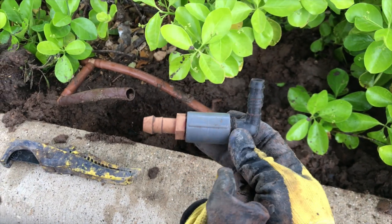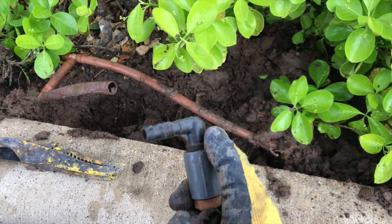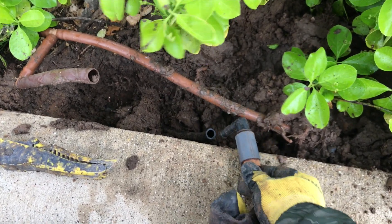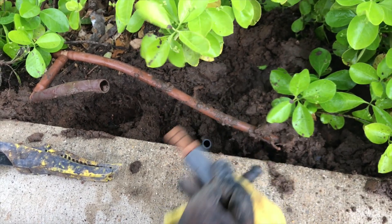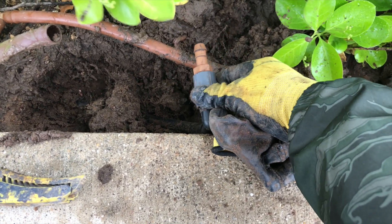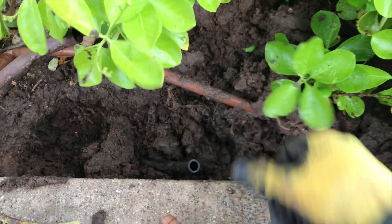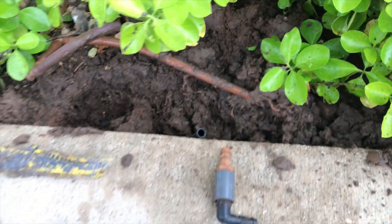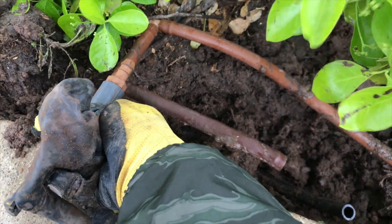This is the setup that you're going to want to use. I've got a half-inch threaded coupler — it's threaded on both sides. I've got this black fitting which is my swing pipe fitting, so it's the right size to go into my swing pipe. And then I've got a male adapter that's the 17 millimeter that's going to go into this. What I'm going to do to get that kink out is put this elbow on here shooting out straight over, then put a little piece of drip, move this over, put a T and put a small piece between here and that and then go into the T. Essentially what they did here except they elbowed over.